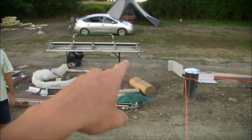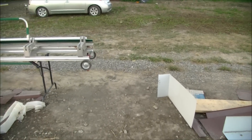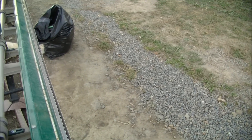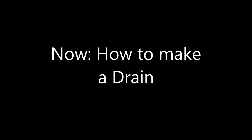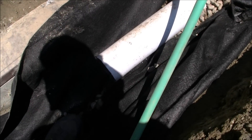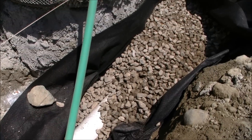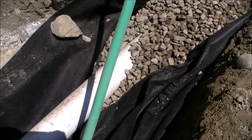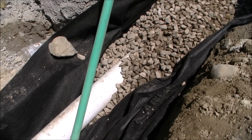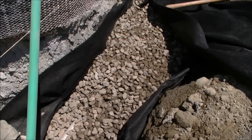We'll have to come out and see what happens during a downpour — come out and get real feedback. The goal of your drain is to allow water but not dirt, because dirt will eventually clog the drain itself. Most of the time you'll be using geotextile to do that. The way to do it is: put the geotextile first, add a little bit of gravel, then put a PVC or black perforated pipe, add some more gravel on top, then close it with more geotextile. After that you can put dirt or soil on top as a final surface.